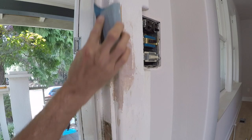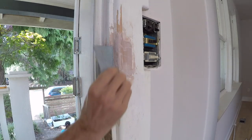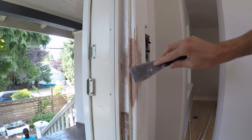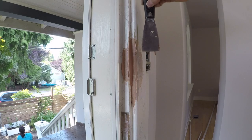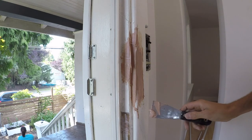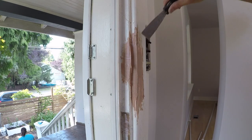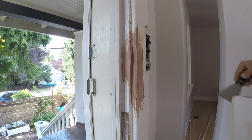I'm wrapping the sandpaper around and getting it right in the corner to start carving out that profile. I've taken the folded piece of sandpaper and gotten right into the corner to sharpen it up a little bit — making sure there are no more boogers and nothing sticking out past the surface. Coat number three for the profile part. I'm loading the material on there and then working with it, taking my time to make sure all the voids are filled for a nice smooth process. Got all the material loaded on, now doing some quick finish passes, keeping in mind that I can either shave or sand some of those bulging edges. At this point I'm also using the excess to skim coat the door.